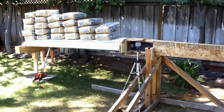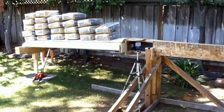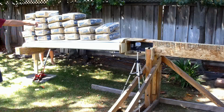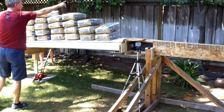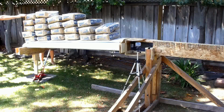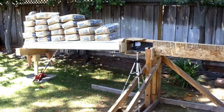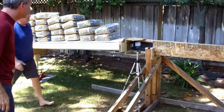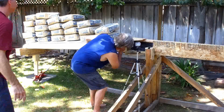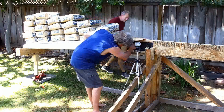I had a finer tuning. Yeah. Woo! Where was that snap? Somewhere in here. Staying clear. Going down. Whoa! Where'd it fail? Top spar cap. Somewhere in there. I think it's inside. Oh, wow. The wing's fine. We pulled the fitting out of the shear web.